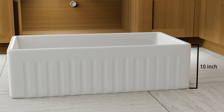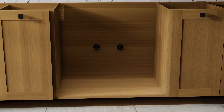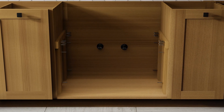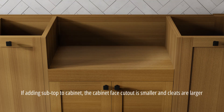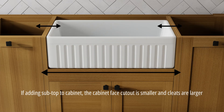Step 1. First, measure the actual height of the apron. You'll need to build supports and a frame inside the cabinet based on sink measurements. Construct a wooden support frame to fit inside the cabinet opening, ensuring sufficient clearance for the water supply lines between the support and the finished wall. Position the support frame so that when installed, the top of the sink will be level and flush with the top of the cabinet. Set the height of the shelf so that the top face rim is level with the underside face of the worktop.